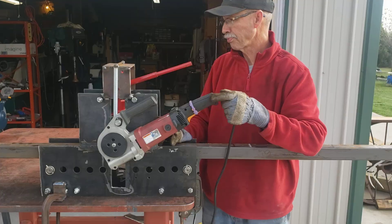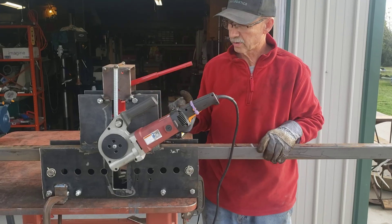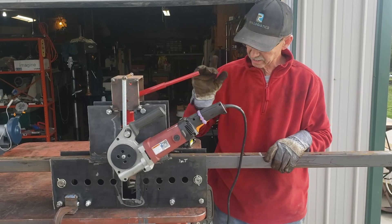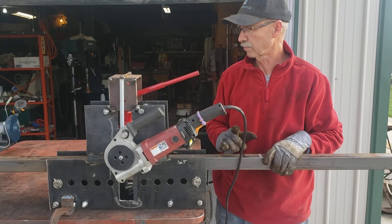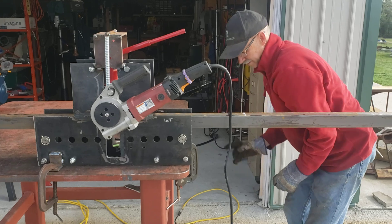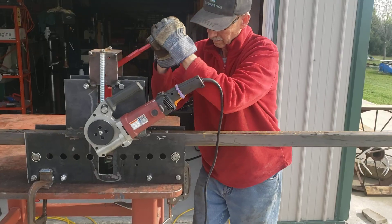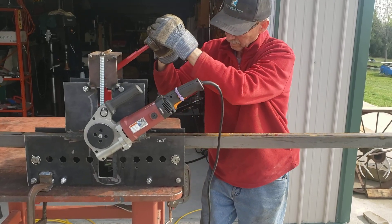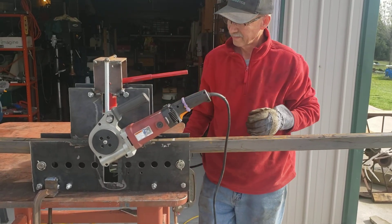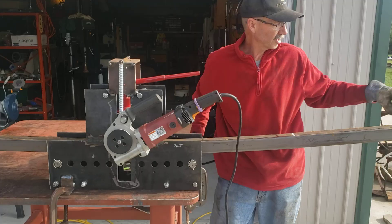It gets kind of warm. I'll run this until the center roller goes to the mark, depending on which direction we are — you can switch direction. I've been clamping down here, but lately I've started clamping down gradually as it's rolling, so it doesn't have any pronounced crimps in the pipe. You've got to clamp pretty good. You can switch directions, but it's pulling pretty hard. It's already starting to put a little bell in it.